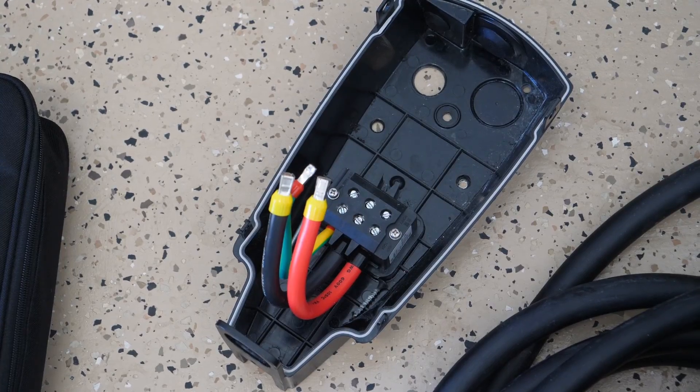The older Gen 2 charges at a whopping 80 amps, which is not even required for the newer models that only charge at 48 amps. The Gen 3 charges at a maximum of 48 amps, and that is 11.5 kilowatts. People are upset about the drop from 80 to 48, but it's healthier for the cars to charge at less. Also, less amps means less heat. The Gen 2 chargers had issues with overheating, and I heard from electricians about weird stuff you get with really high amps. Having it go down to 48 probably cuts costs too, and your car likely doesn't go up to 80 amps anyway.